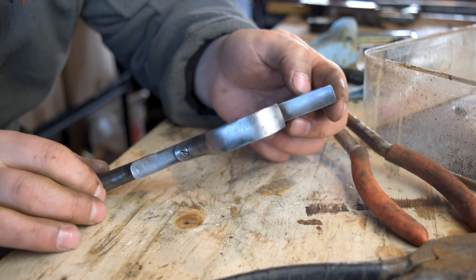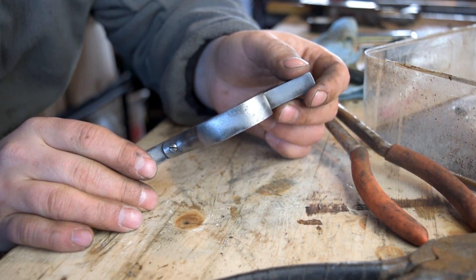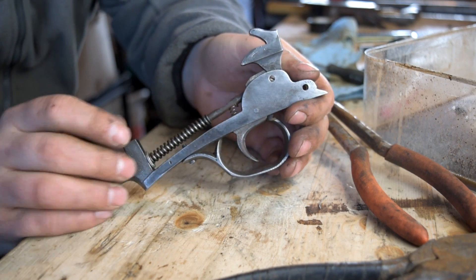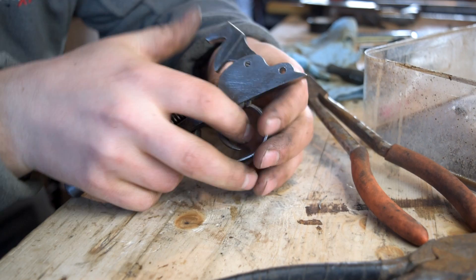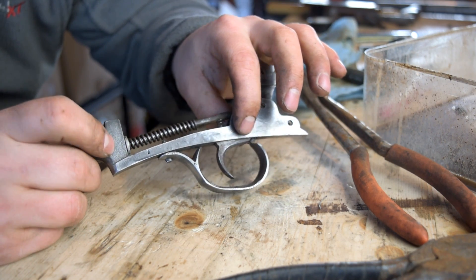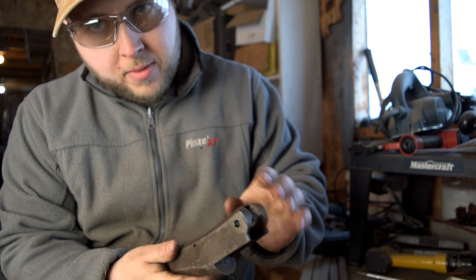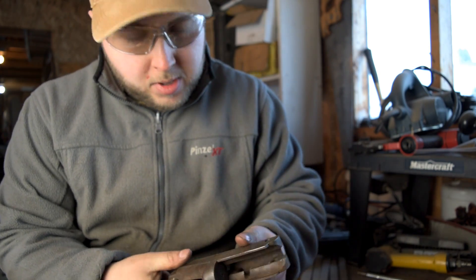I'll give it a little bit more oiling, but this is pretty much going to stay like it is. I'm not going to polish it or anything crazy — it has a nice amount of character. I'm not going to polish out the little dents and nicks and pits because they're just what you'd expect from a gun this age. This hammer was extremely hard to pull back, almost to the point where you need two thumbs, and really gritty. Now it's just very nice and silky smooth with all that grit cleaned out. I oiled the pivot and the trigger pivot. I've completely cleaned out the inside of this action. I'm going to throw it on the wire wheel and see how clean we can get the outside. I might end up sanding down to raw steel and bluing it — we'll see after cleaning it up.